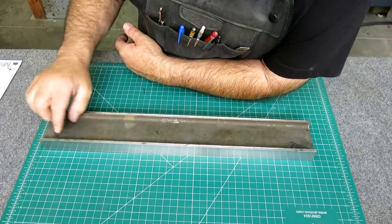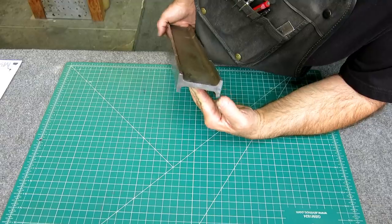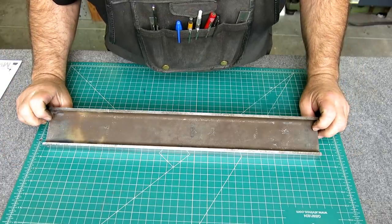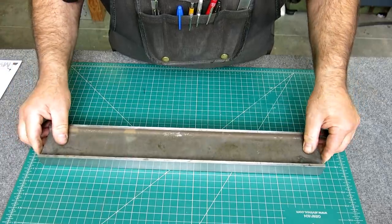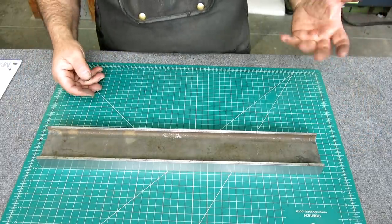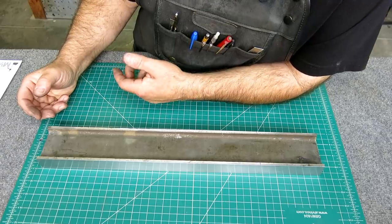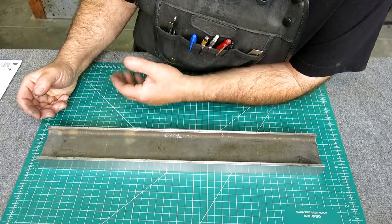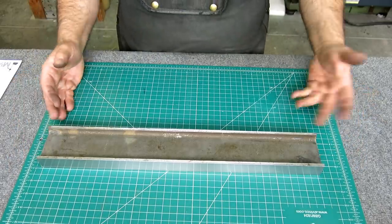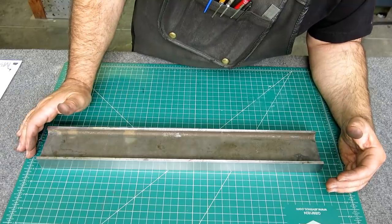What's interesting about this one is it's made out of a piece of structural I-beam. So let's take a look at the end there — somebody found a piece of small I-beam. You can see some of the rolling marks that they print on the side. And then they cut the flanges down and made kind of a straight edge out of it. They machined it, but it wasn't scraped or even ground actually. It was kind of beat up when he brought it over — he was out a few thousandths and wanted it better. I said, boy, that is right at the extremes of my travel on my machine. Anyway, it sat around for a couple of months and then I fired up the Brown and Sharp and said, let's give this thing a go.